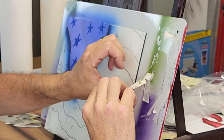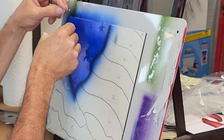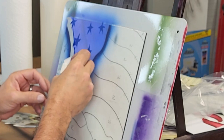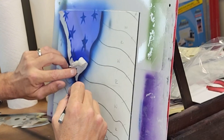Now here's where I'm going to be taking that tape back off. As you can see, I peeled some paint off of my board, and that's because that's a real shiny board and that paint's been on there a while. But that's what I always talk about - scuffing up your surface. If you don't give your surface any tooth or any bite to grab that paint, your paint can peel off. That's a very good example. Now you can see why I set those pieces aside - so I can lay them back in here.